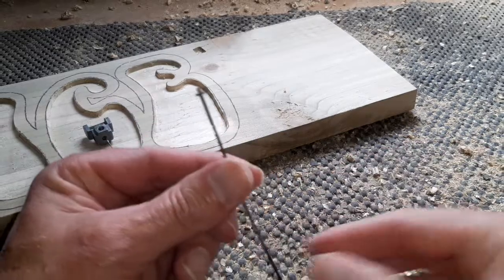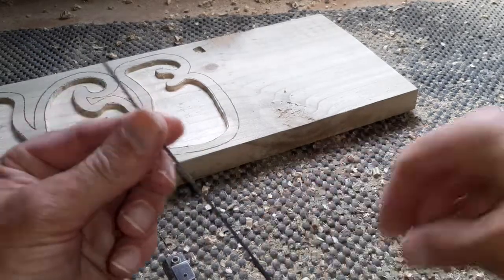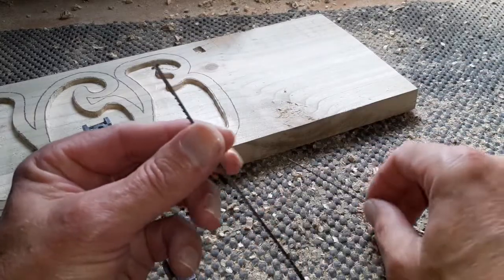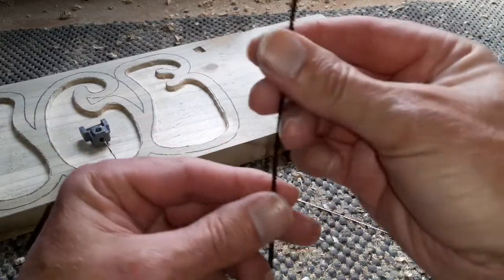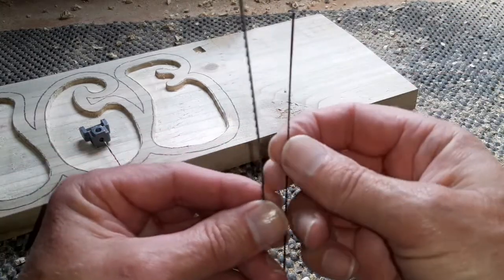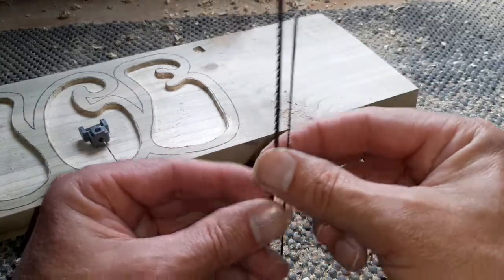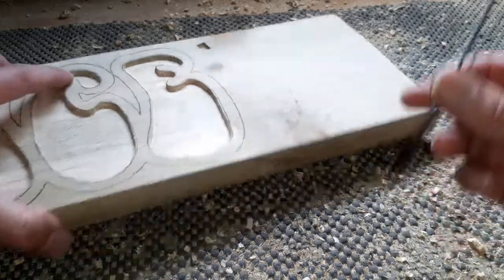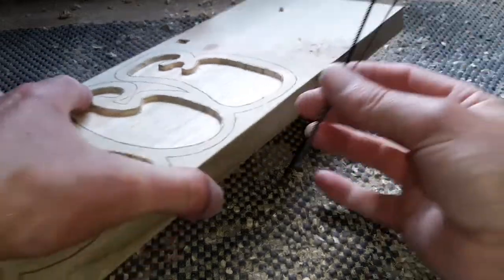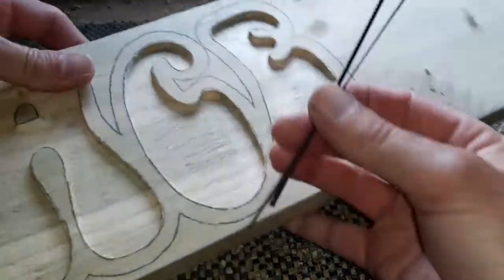Whereas the other two blades, the pin blade, and there's a pinless one here, which is ideal for smaller, intricate projects. You want the teeth facing towards you, smooth on the way down and rough on the way up. Same with the pinless blade, but always have the teeth facing towards you. You're going to feed your wood into the blade, like I've just said with these, and turn it and feed it again and turn it and feed it again.